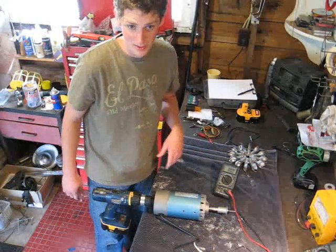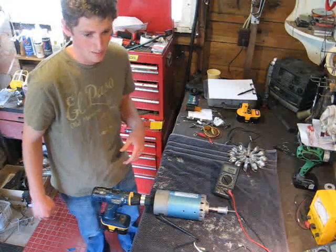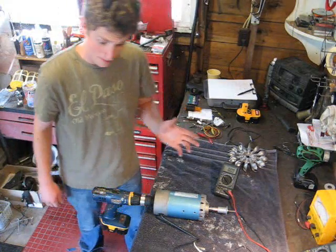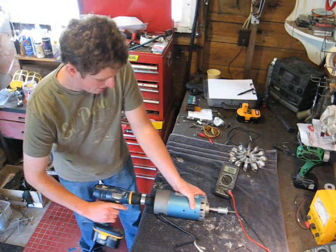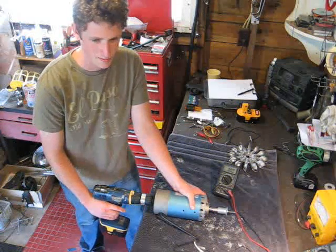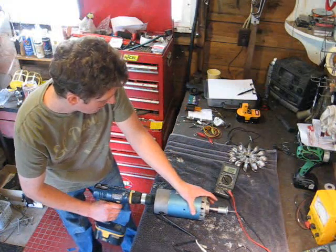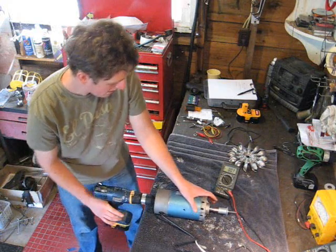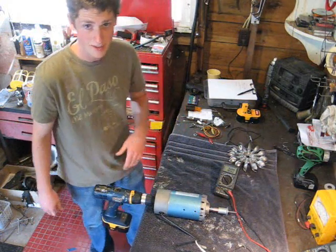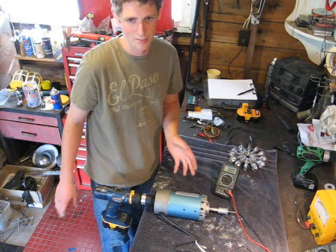Now that's not enough to charge a 12-volt battery, but it gives you an idea of what you'll need. You could charge a 6-volt battery at that speed. At full RPMs — around 1,380 — we get about 38 volts. You're not going to be spinning that with a wind turbine, but you might be in a hydro application, possibly geared up.